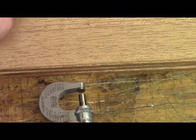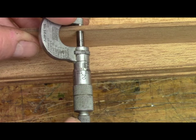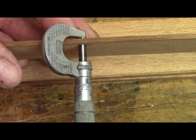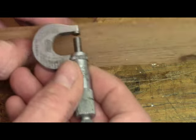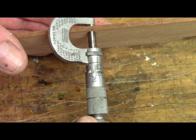I'll show the consistency these strips afford for the cock beading. This one is three thousandths under the desired dimension. This one is six thousandths under. That one is five thousandths under. And that one is three thousandths under. So between three and six thousandths under — that's only a three-thousandths of an inch tolerance range. When you consider that newspaper is three thousandths of an inch thick, that ain't too bad.